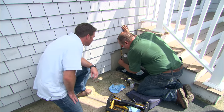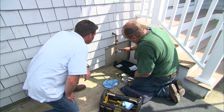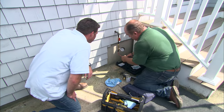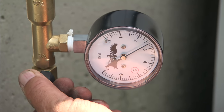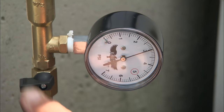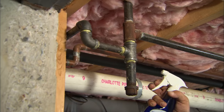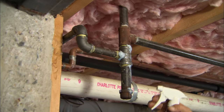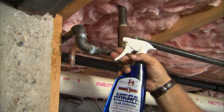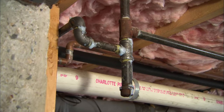I've got most of the connections done out here. Here's a secondary shutoff outside, and this is a pressure tester. I'm going to pump up all that new piping to about three pounds of pressure and close it off to see if it holds. Inside, I like to be double sure there are no leaks and do a soap test — if there's any leak, a big bubble will show up. Looks like we're good.